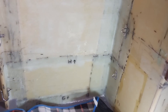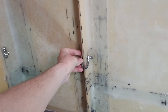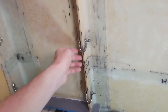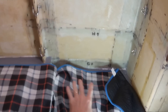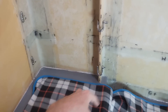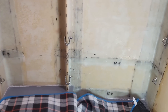I've dry fit all the stainless here so you can get an idea of what the pad eyes will look like in here. And where I glassed in the pipe sections in frame C4.5, I thought about it a long time and decided the best solution is to use these big D-shackles. When you don't need them, they just hang down out of the way, and when you do need them, swing them up and run lines through them. I figure here I can have a seat cushion and a backrest and these can help hold that in place. Gear could be stowed here with lines wrapped around it, providing a very customizable solution for stowing gear.